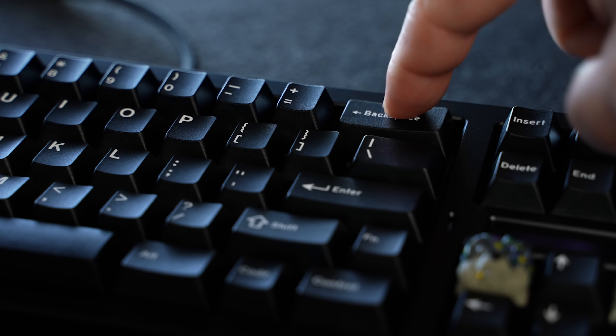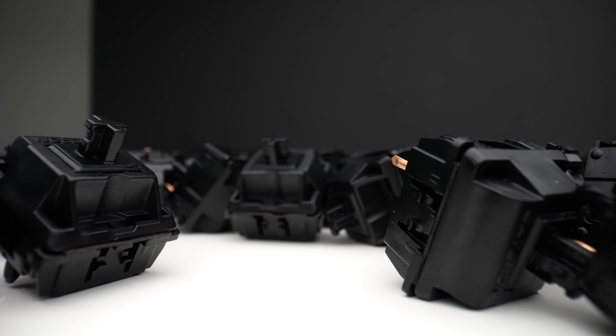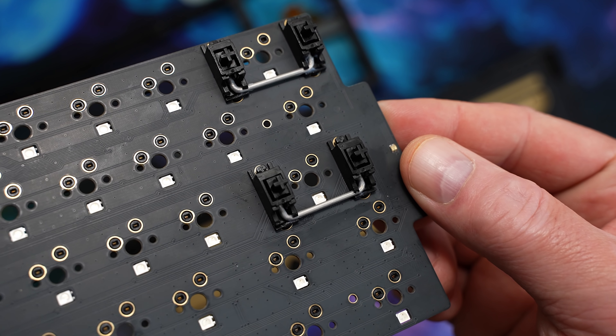Unsurprisingly, not a huge fan of the silicone in this board. The backspace is probably my favorite sound overall. The board comes off pretty clacky — a lot of the low frequencies are muted due to the silicone. I tried to offset this by using some Gateron Oil Kings, which are both filmed and lubed from the guys over at Lubed Switches. I like the board much better with all the silicone removed except for the space bar, which sounded pretty off. So I decided to set this up in southpaw config — and the board sounds much better running in southpaw with no silicone. First time with the TX stabs, by the way, and they are super easy to tune — believe the hype.